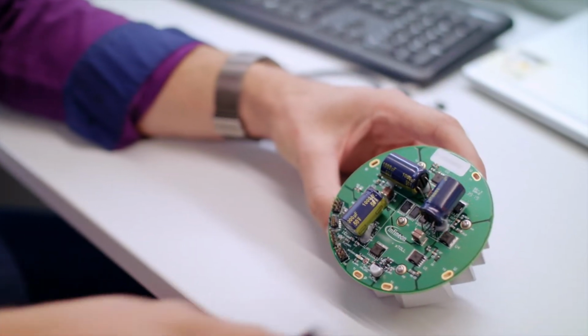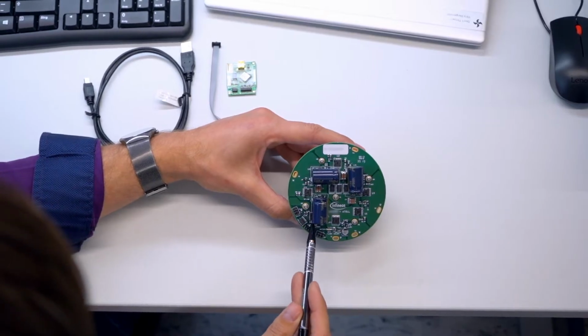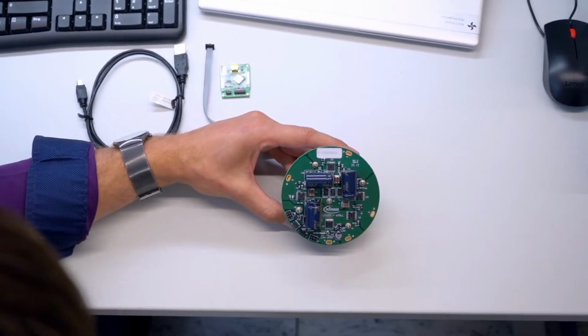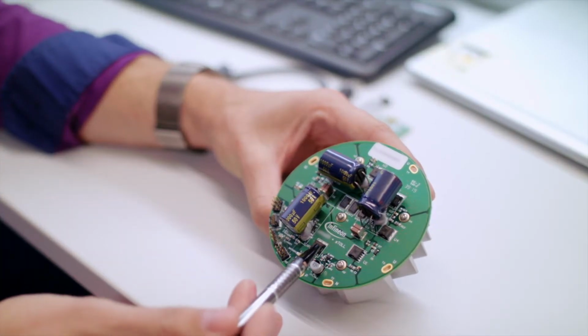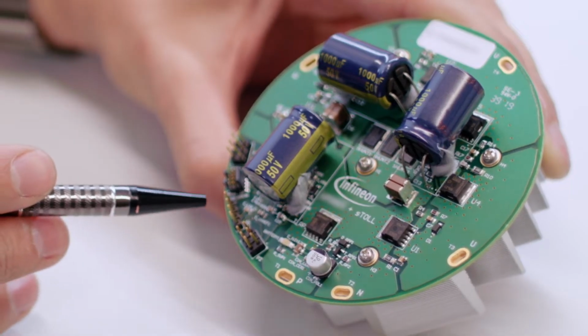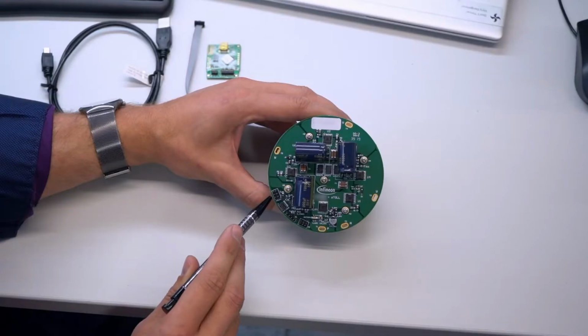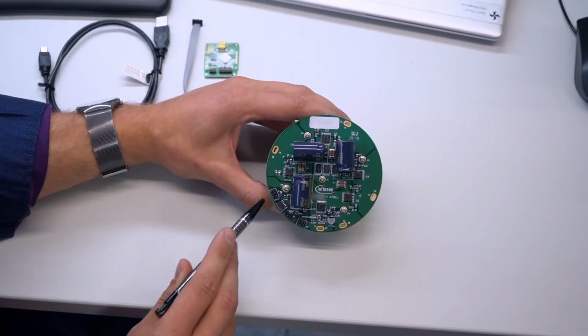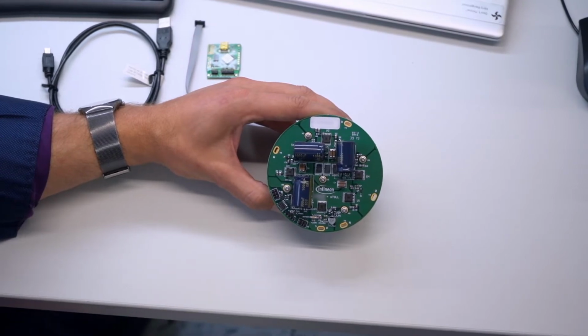The reference design is based on a 6-layer PCB. It consists of the system-on-chip microcontroller from the embedded power IC family and 7 OptiMOS 6 STOL MOSFETs. Terminals on the side will give you access to the debug port. We'll have additional connectors for Hall sensor interfaces, for LIN, and for additional GPIOs.